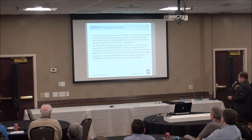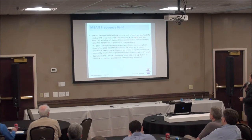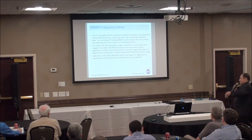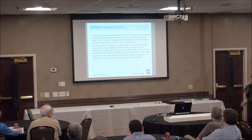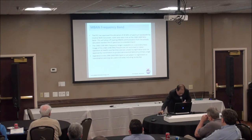Because the 2.4 GHz ISM band is very congested, the FCC has approved an application for a 40 MHz spectrum bandwidth from 2360 to 2400 MHz. The catch is: if you are inside a healthcare facility, you use 2360 to 2390 MHz. As soon as you step outside, you have to switch to a different frequency band, or you can switch back to BLE if you want to.